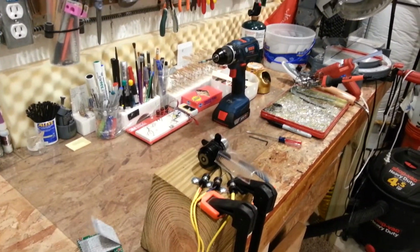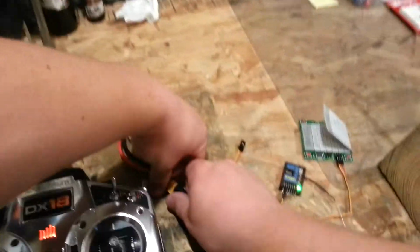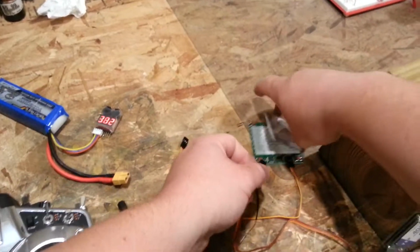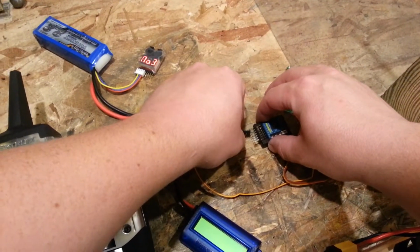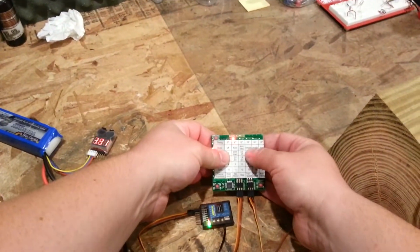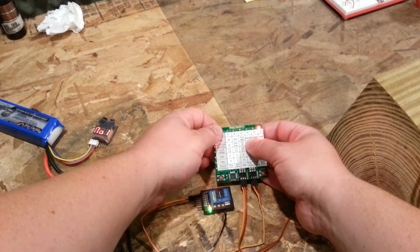Full throttle. And nothing. Okay, so what that's going to do is that'll snap those things into the side of the composite plane. So I don't want that. So I'm going to shut this off. We're going to switch over to a programming card. And what we're going to do is we're going to switch the braking to smooth this time. Throttle cut's on. Okay, smooth. That's what we want. Okay, so now that's done with the initiation, let's change this to smooth. Send it.